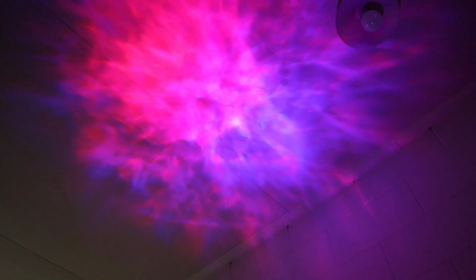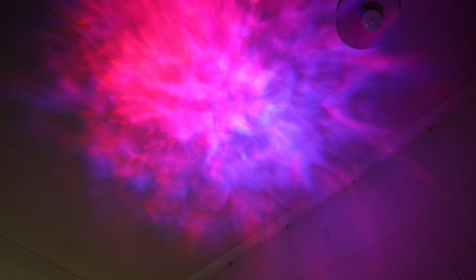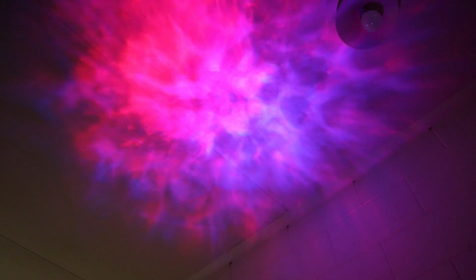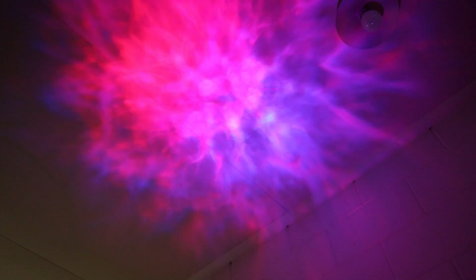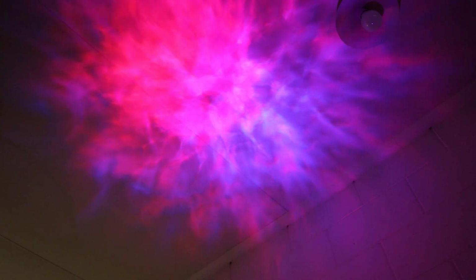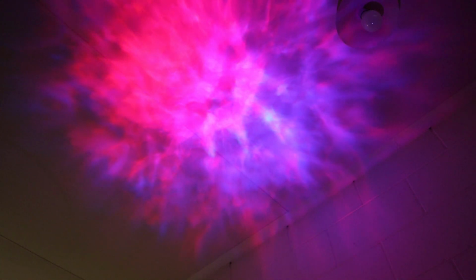Makes me wonder if maybe the IC for the red got damaged as well. Not completely, but perhaps it's ignoring the dimming signal. Something to look at, I suppose. But anyway, that seems to be going, and I just need to figure out what that other IC is. So I'd love to hear your thoughts. Maybe you're in the industry more and will know right off the bat what sort of 8-pin IC has 3 inputs and 3 outputs and 1 inverted. Maybe it was a little micro running basic code just to do that.